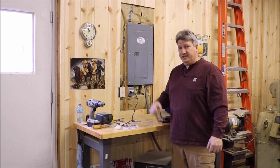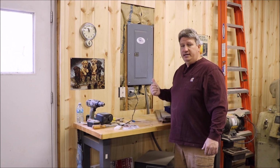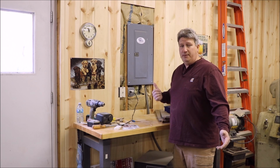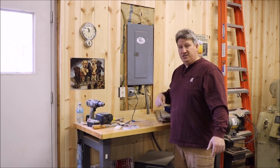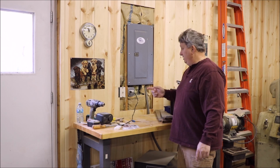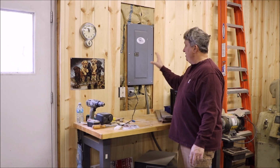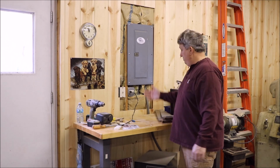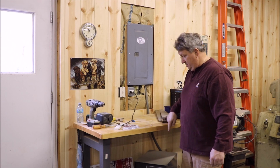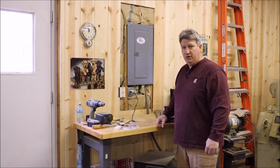But bringing us back to this is the electrical service that's coming into the shop. I have 200 amp service here, and it supplies all the power to the shop. 99% of the machines in the shop are three phase, so I have a rotary phase converter, which I'll show you in a second down below. But this is the service panel, and the way I had to do the electrical service when I installed it all was having the panel flush to the walls. But then I've got some big heavy cable that supplies the shutoff to the power for the phase converter, which is a 20 horsepower phase converter,